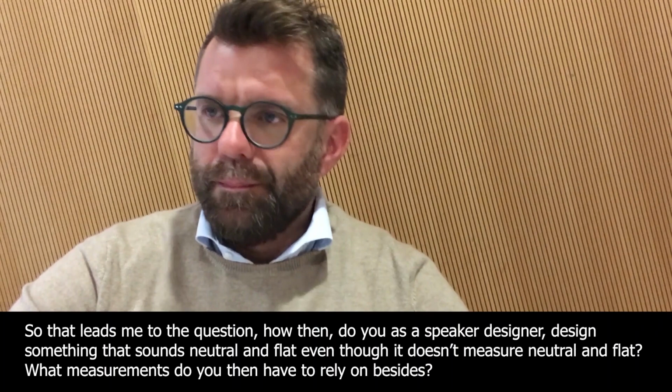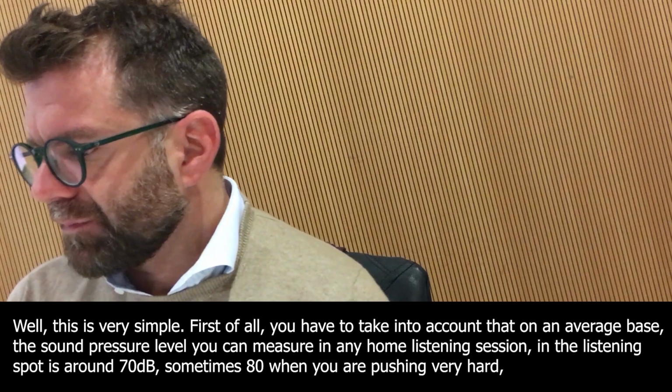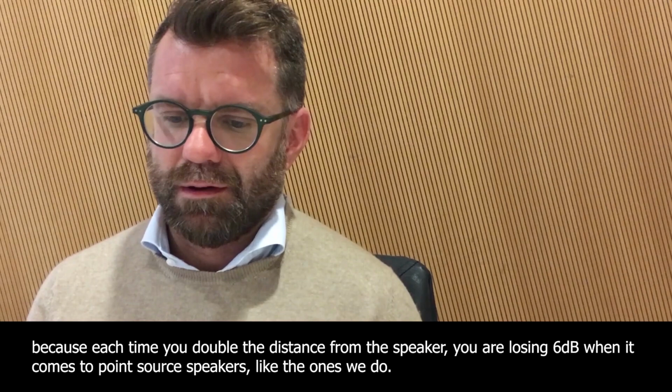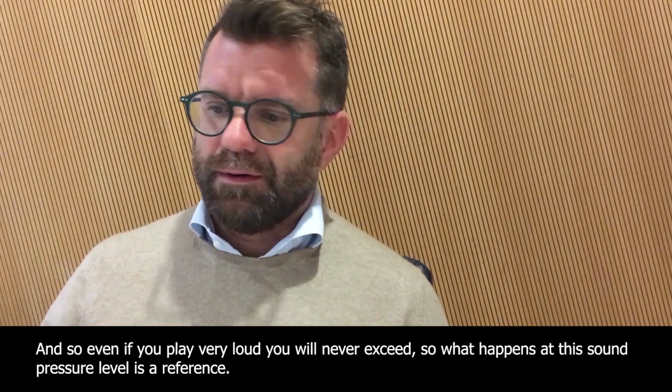Well, this is very simple. First of all, you have to take into account that on average, the sound pressure level you can measure in any home listening session, in the listening spot, is around 70 dB, sometimes 80 when you're pushing very hard. Because, you know, each time you double the distance from the speaker, you are losing 6 dB when it comes to point source speakers, like the ones we do. And so, even if you play very loud, you will never exceed that.